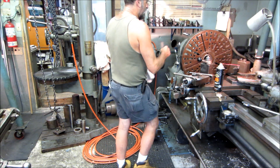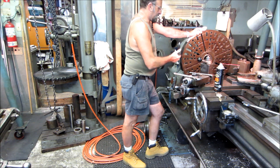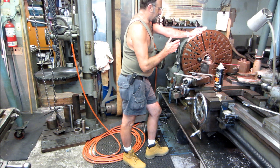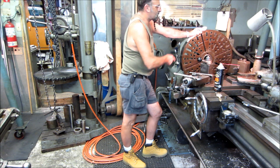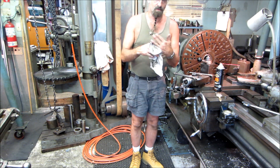We're going to go ahead and grab up T-nut combinations and we're going to get the sprocket mounted in there on the face. Then I'm going to show you getting that set up and centered. And then I think we're probably going to drag out that grinder finally and I'm going to show you how to grind the first tool bit — it's going to be a trepanning tool bit.